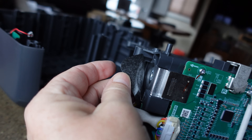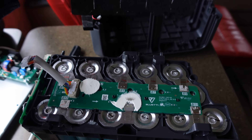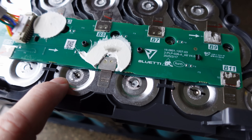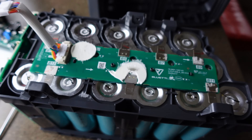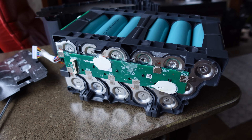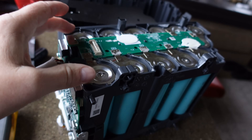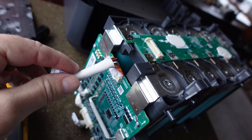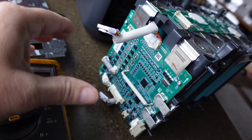Try to take apart these covers and get a look at how the cells are put together. This wafer board was kind of just glued on there for protection. Here's the cell ends — looks like they're all laser welded. Looks like there are 16 cells in the pack. At 3.2 volts per cell, they combine on the output here for pretty close to 52 volts.